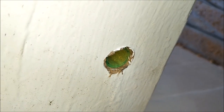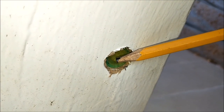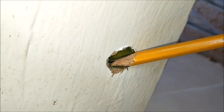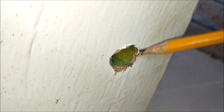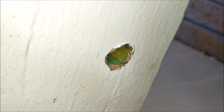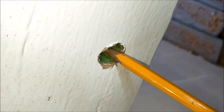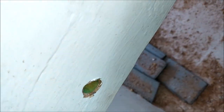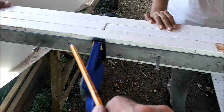Yeah, that's our spacer. And the liner, we're going to epoxy that green rubber, plastic, whatever tube in there to keep the inside of the wood dry. We'll fill that with epoxy and then slide that in, and then epoxy seal this end and the other side also. And then we take a small tree branch, the exact size of this hole, and we shove it through there and push all the epoxy out of the hole. And then we're done. And we do that to every one of these holes here, all the way across here.